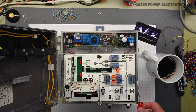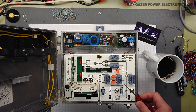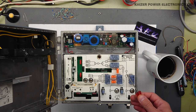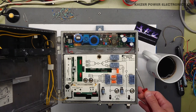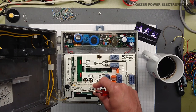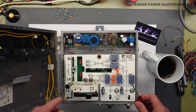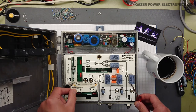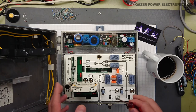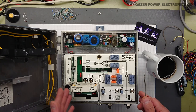Now the reverse transmitter is what would be used in a more modern setup, and I also think this is why these are getting changed — more people are getting on high-speed cable TV internet, so they simply need to upgrade these boxes. Very few of the line RF amplifiers are actually equipped with the modules for transmitting data back, so they are probably very limited in upload speed and therefore are getting exchanged for newer systems.